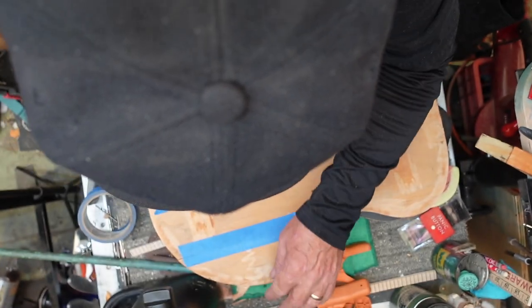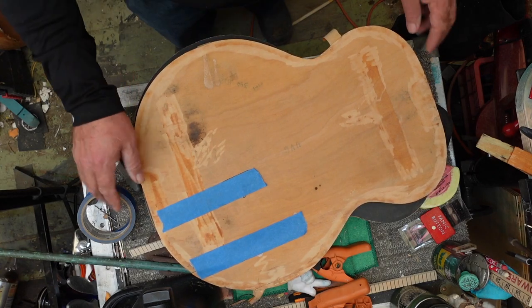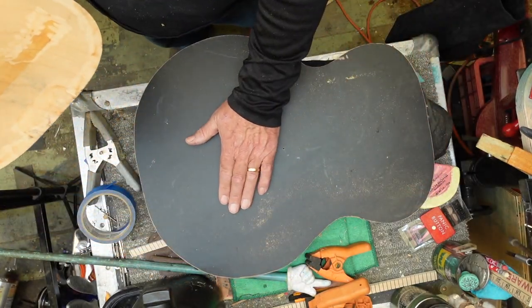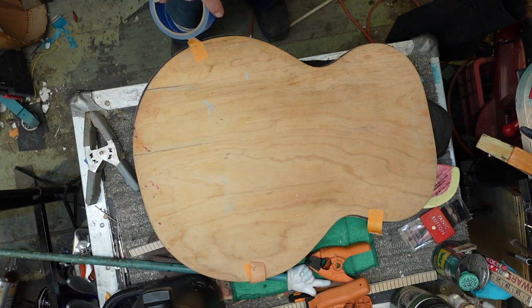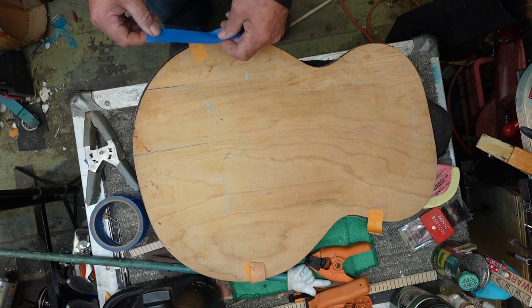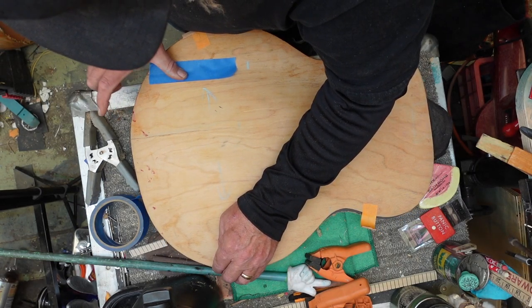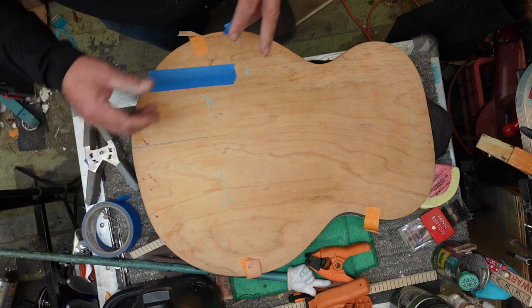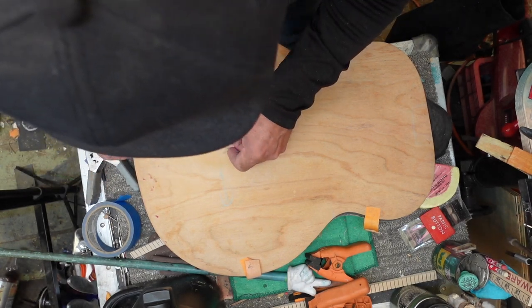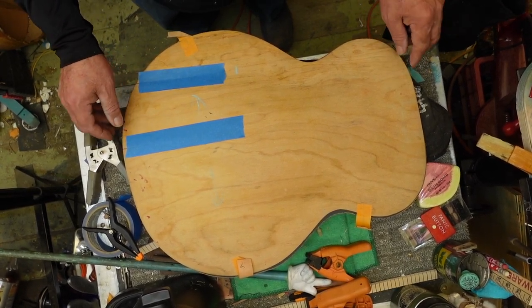So I'm going to put my fat belly on over here. We're going to put that one down. And we're going to bow this the way it wants to be. Now, later on, when I'm fixing the cleats, I could actually put cloth or something underneath here to get that arch to stay like so. But the main thing we want to do right now is get that steam to stay in there without making the crack wider, because that's one of the potential outcomes, the crack gets wider.